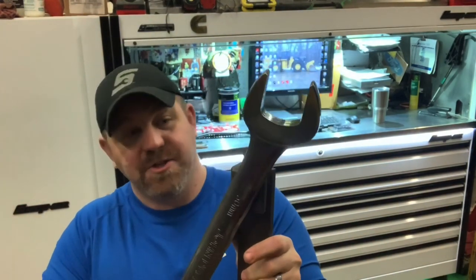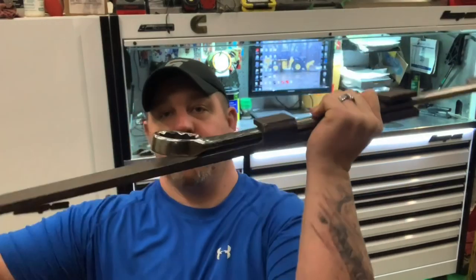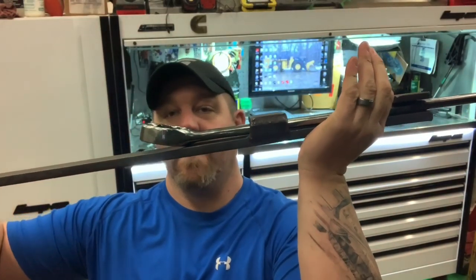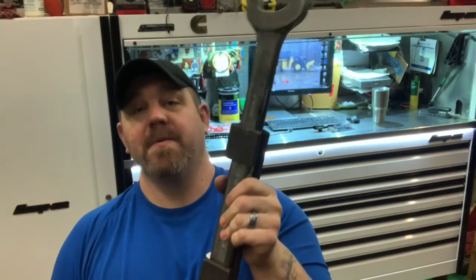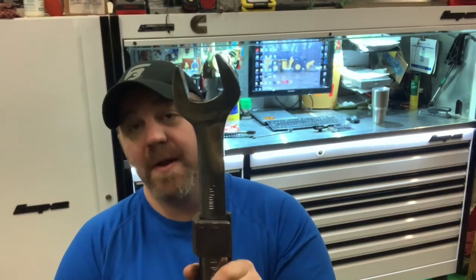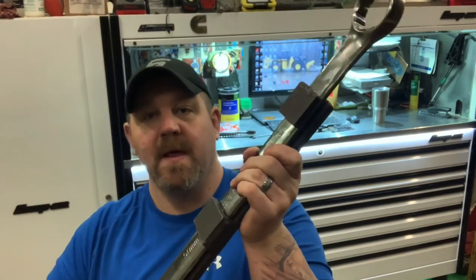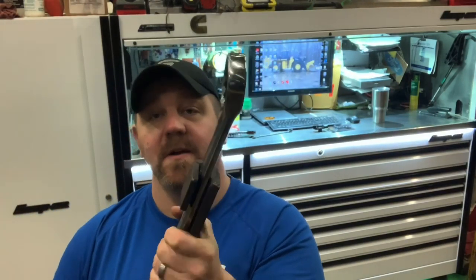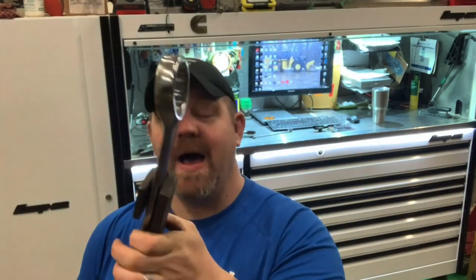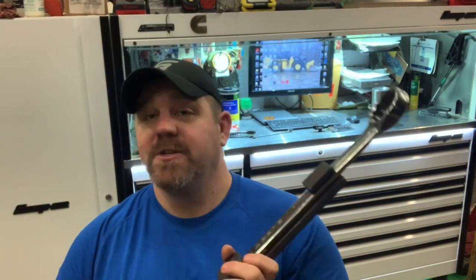There is a slight issue with the offset on the box end — it has to be away from that flat bar. That's one of the flaws in the design, but no big deal. We just flip the wrench over a little bit. Sometimes it doesn't work perfect for the open end, but on the box end it does work in both situations. Just flip it over and it clips in. You do have to flip the wrench to get the right pressure for the direction you're turning the fastener, but it works well. I'll put a complete length, height, and width description in the link below.